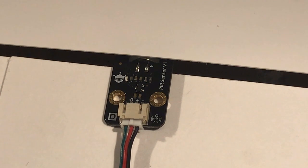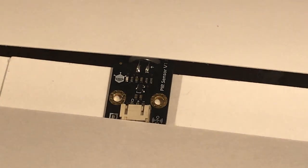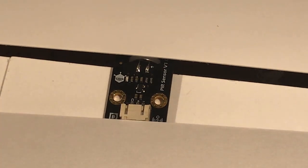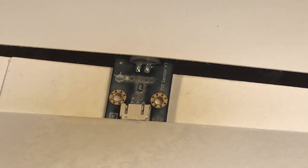Once you've got that part covered up, you can then come back and cover up the back connector if you like and apply your conformal coat. Make sure you do this in a well-ventilated area and let that dry. We'll also show you how we do this with moisture sensors in the video linked in the description.